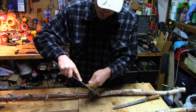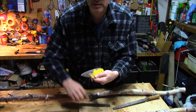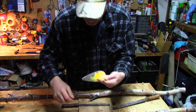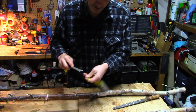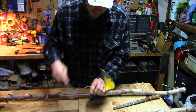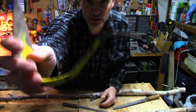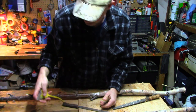What's going to happen is that when you pound this thing in, the metal will rust a bit and sort of glue itself in by virtue of that rust. You think of rust as a bad thing, but if you take a nice smooth clean piece of metal and let it rust a bit, it becomes abrasive. So that rust actually helps hold it in place. I've just scratched it up a little bit so I can see a bit of shine here or there — that's all you've got to do.